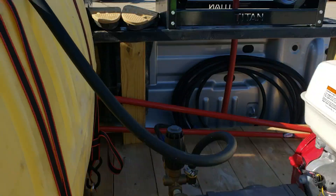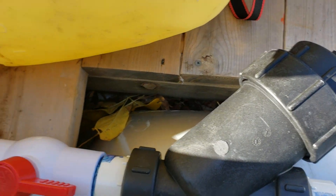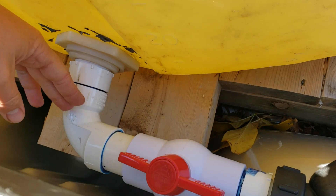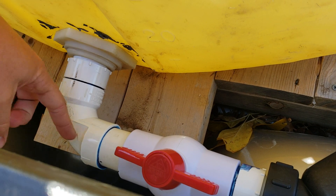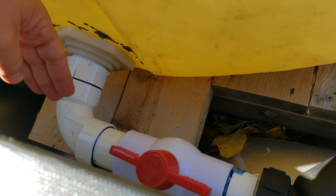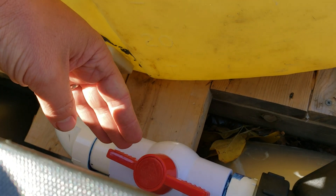He's got his two hose reels, but again the big thing is the plumbing — keep your plumbing as big as possible. He's not doing a straight tee; this is a 90, so the water is able to turn this way. Sometimes when you see a tee, the water is just bashing into it and not getting good directional flow.